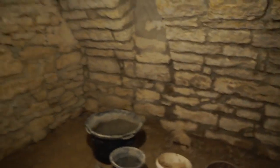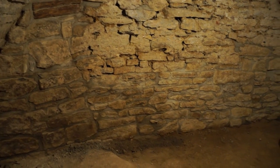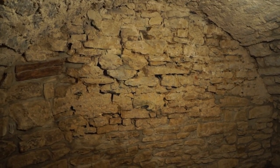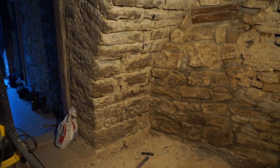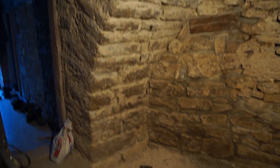Earlier this week I did the lower half of this wall. The top half is going to be plastered, so I'm just going to roughly fill the holes and then plaster it with a lime-based plaster. The only thing left to do now is to clean those stones a bit, pull out the loose mortar, repoint that little section.